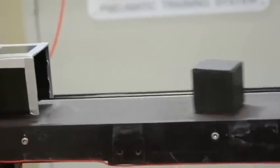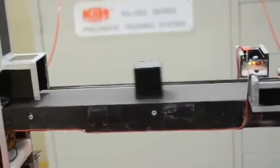The process starts with a programmable logic controller, which will send the logic signal to the solenoid valve. The valve will then allow the air pressure to flow through the double-acting cylinder. Then, the cylinder will extend to push the block onto the conveyor. The conveyor will bring the material to the through-beam sensor. When the connection of the sensor is interrupted by the object, it will send a signal to the PLC that the system is ready to dispense another object to the conveyor, repeating the whole process.